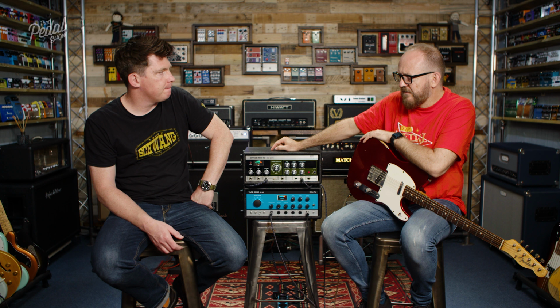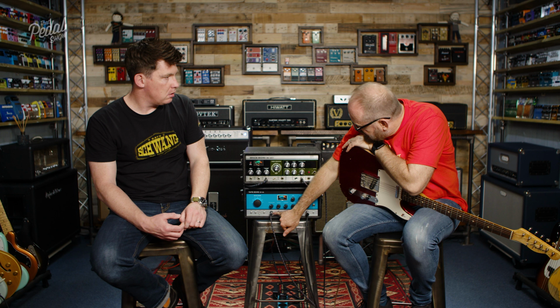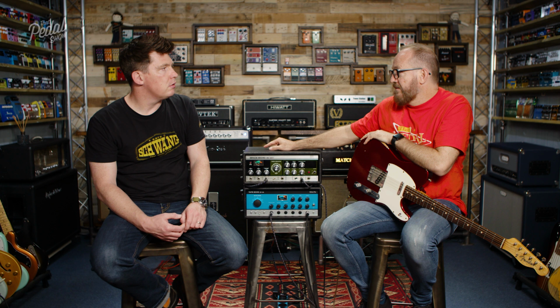I have a question about that. Yes. Input-wise, we've kind of had to hit it with a buffer to get it bright sounding. Sure. So is that something to do with the kind of input it has then? Yeah. So it's one of the issues. For example, on here we have the high Z input. Because these were a lower impedance input. Right. You know, so used as designer studio gear. Think of the CE1. Yes.